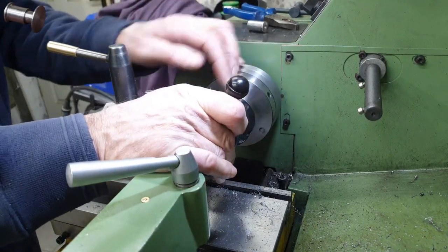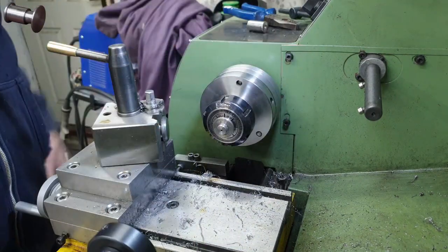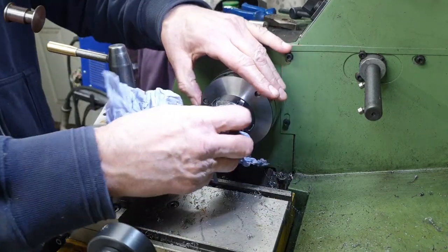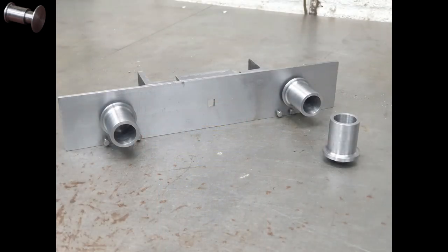There's a bit of a challenge on the design here. The thread needs to be cut really tight up against the flange to enable the buffer base to screw properly into the buffer beam. However the die I have, which is just a cheap carbon steel item, is tapered at both ends so I could not thread the full depth of that shoulder. I've ordered a new die which hopefully will overcome that issue. If not I may need to tweak the design accordingly.